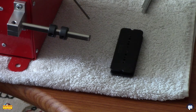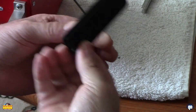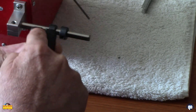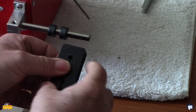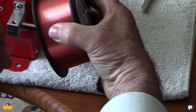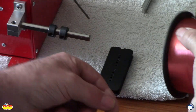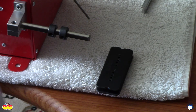We've got the burrs off. Next, take the bobbin — these are the 50s style bobbins with a little ridge where the wires will come through. This would be the top of the bobbin. Place it bobbin side up. We've got a roll of poly wire here, and this wire is really thin, so if your eyes are like mine, you'll want a good set of reading glasses and make sure you have good lighting.